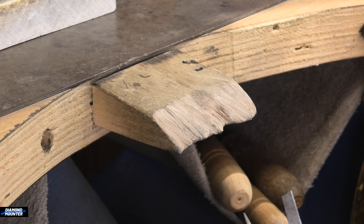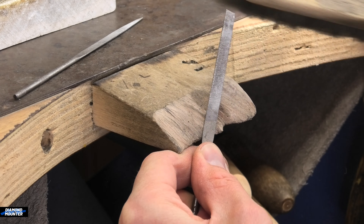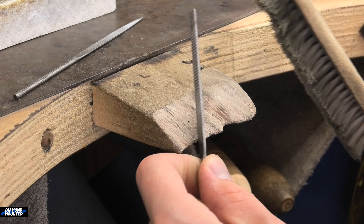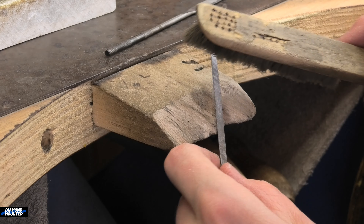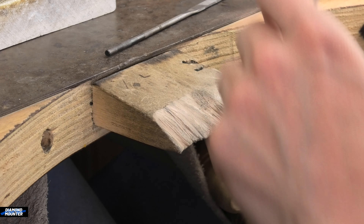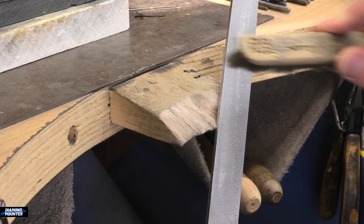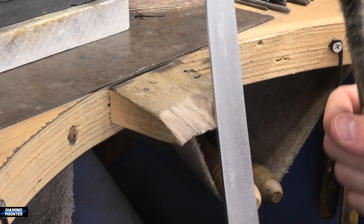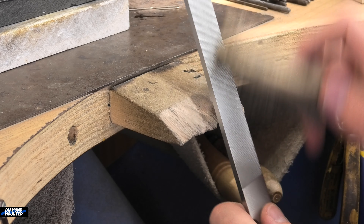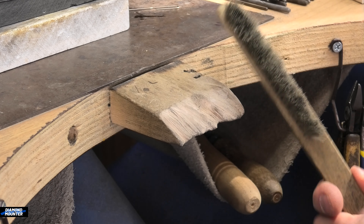Needle files — mine are all dusty with white dust from filing a resin material I was working on. That dust can affect the cut, but you can brush it out reasonably easily. If I really want to I can ultrasonic them, as long as you dry them afterwards. Brush in the direction of the file blades to clean them out — do it over your skin so you collect any precious metal. Same with bigger files: this one's got aluminium clogged in it from an aluminium project. It's supposed to be a non-stick file but it's got stuff sticking in it. Use a metal-bristle brush for a better job getting metal out of your files.